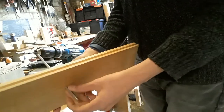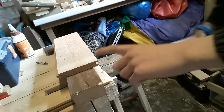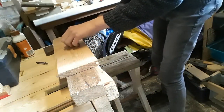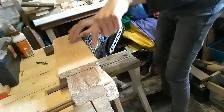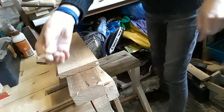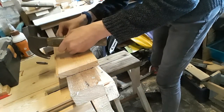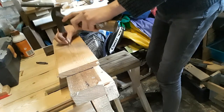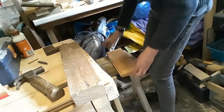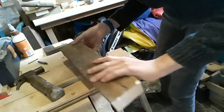The hole is a bit bigger than the actual diameter of this M6 rod. I've got two jaws of the vice next to each other and I want to accurately know where the threaded rod needs to go through into this piece. So all I'm going to do is take a screw and a hammer, insert that through there, and just whack it a few times. And then it's left a mark so now I know where to drill through there for the threaded rod.